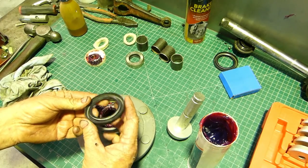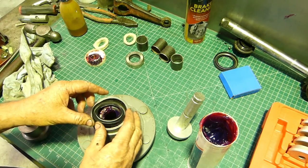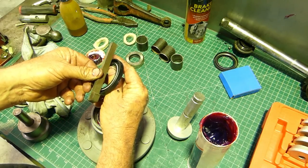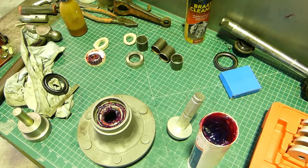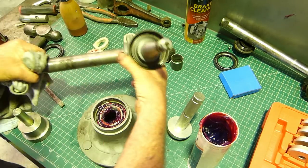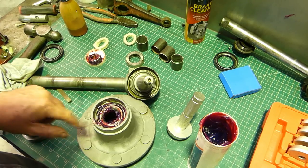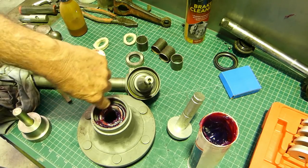Back again. Now the seal - when I was pulling it apart I'd seen it both ways and different brands have different ideas. I had a quick read of the manual and they're saying fit it this way. The lip seal is in a little bit further so when you look at the stub axle - here's what I prepared earlier - there's a little cutout in there and also a shoulder to bring the seal down on.